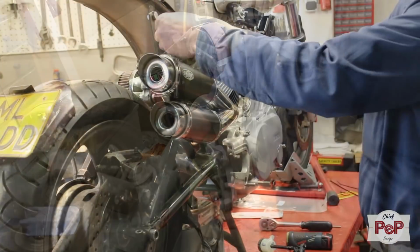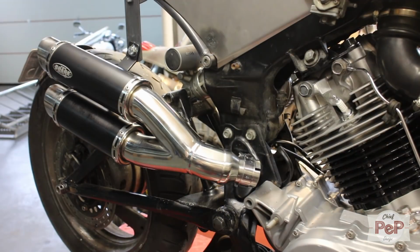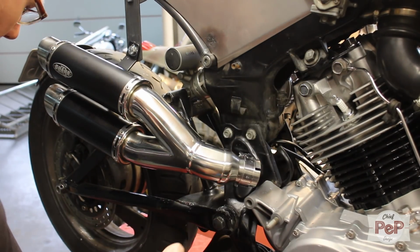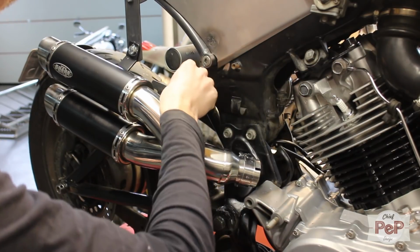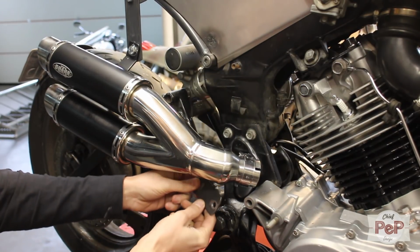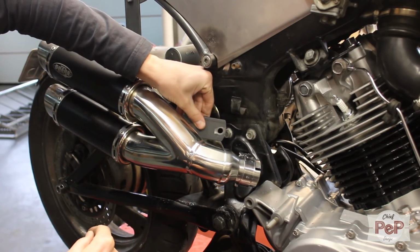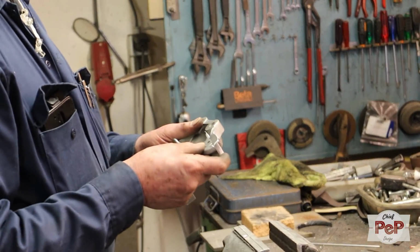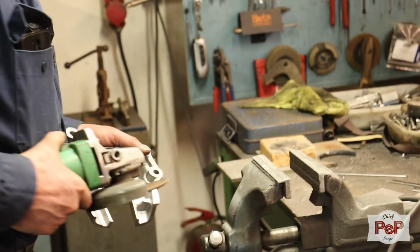Okay, that's done. Now this exhaust bracket really disturbs me. What can we do to fix that? I would like to have the brackets of the muffler coming from this side and that they are kind of camouflaged behind this manifold part. We should make a stud coming from this point, going to the connection point on the back of the muffler. We could even use the original footrest brackets for that. Then we would have to weld a connection point on the aluminum bracket.